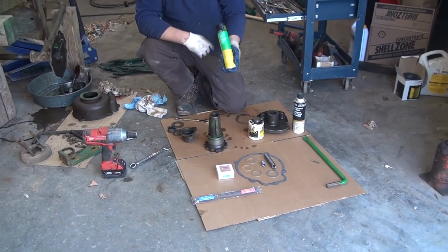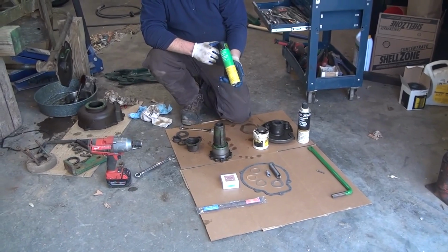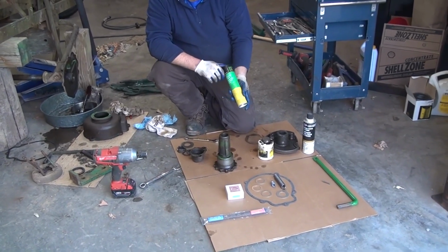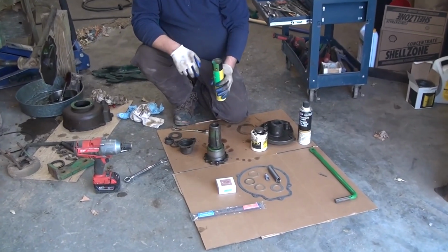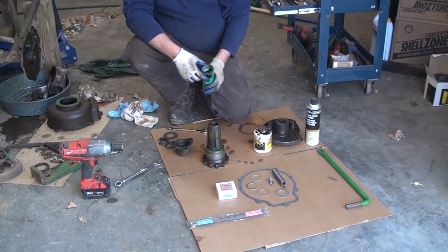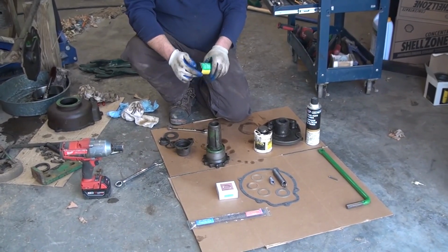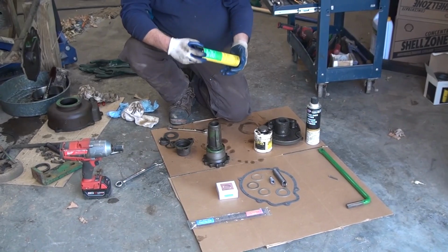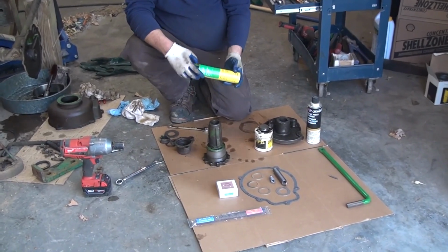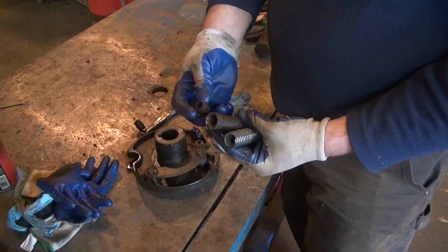And one tube of cornhead grease. You can buy this from John Deere, you can buy it from Case IH. Those two dealers I know have it available. But it's basically a semi-solid grease that, at normal room temperature is sort of semi-solid, but as soon as it warms up, it liquefies. It's used in gearboxes on corn heads. It's also used in gearboxes on rotary mowers and bush hogs. So for this application, it works very well, and it stays inside the clutch housing where we want it.